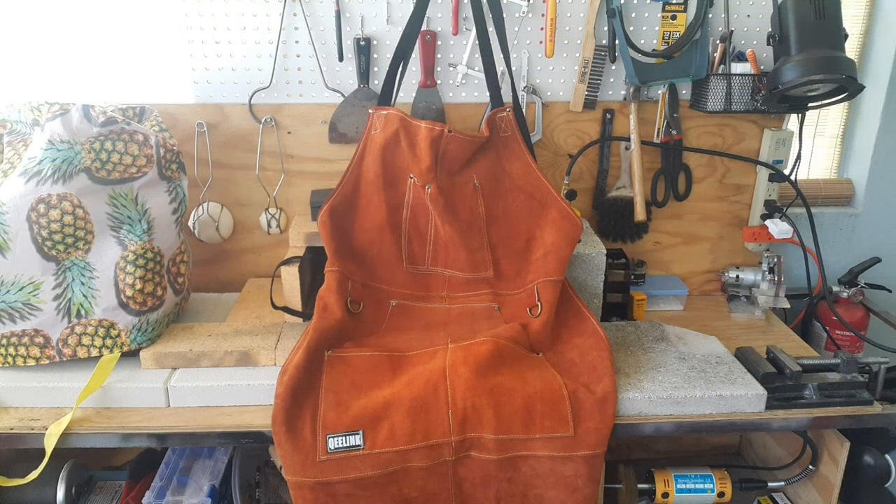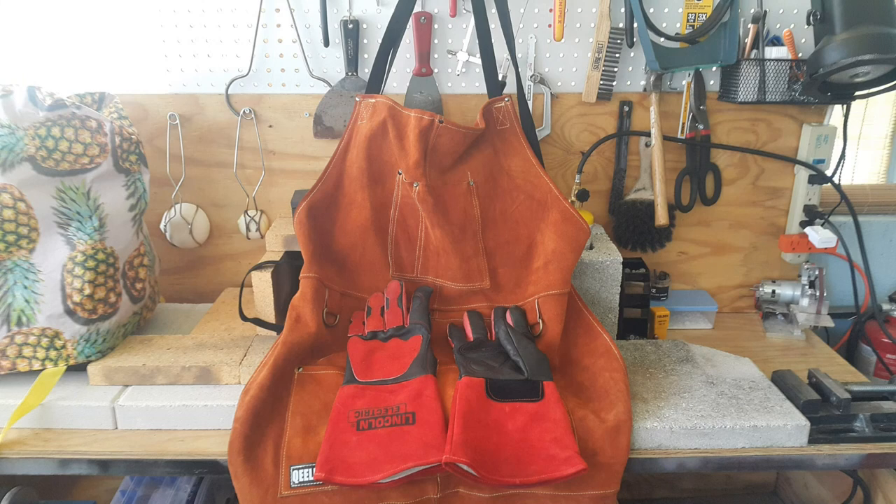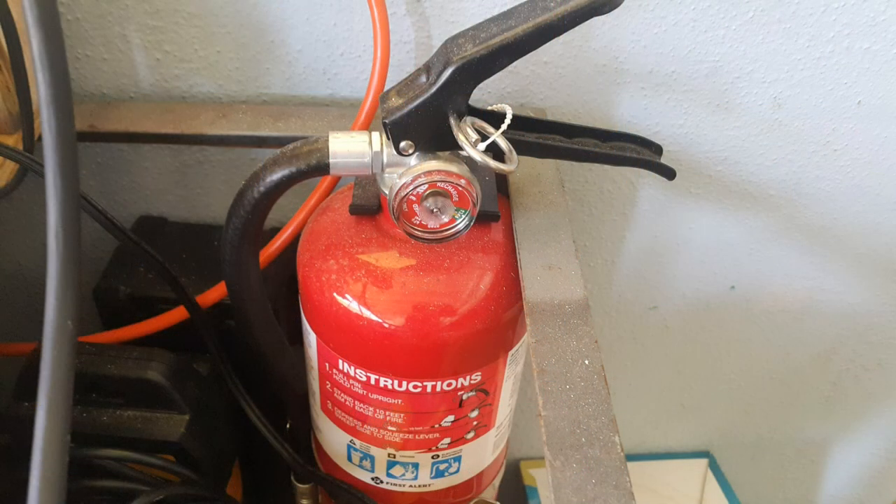Next is the safety gear. I have a welding apron that extends below my knees to protect me from any spills or splatter. A good set of welding gloves that offer good dexterity and the ability to hold tools while I work. I always wear eye protection, and you should always wear thick heat-resistant clothing that covers any exposed skin — denim or similar material works very well. It's also vitally important to have a serviceable fire extinguisher very close by, and you'll want to make sure there are no flammable or heat-sensitive materials around your bench, as anything with a low flash point could ignite.